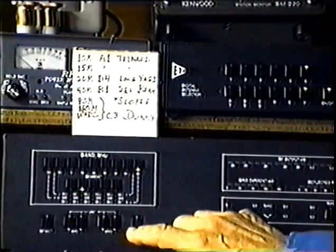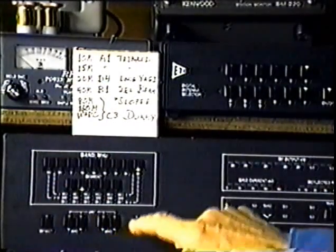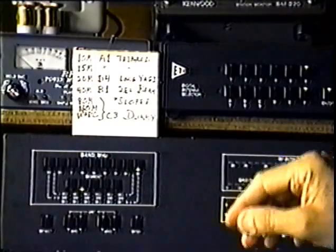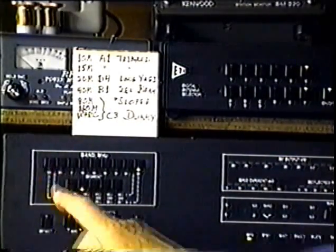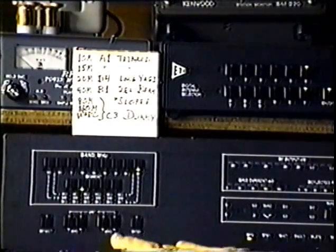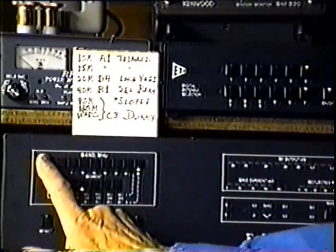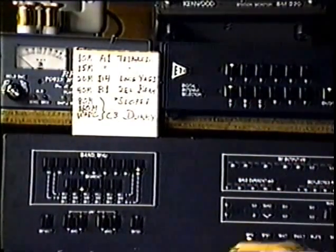All I do is push enter — while the light is flashing, press A1 — and you will see the antenna selector switch to A1 to confirm it's happened. The light will also go out on the enter button at the moment I push the button a second time. So here we go. We're on 28 megs. Press enter, press A, press 1. The light goes out, the antenna switch has gone to A1. That's programmed.